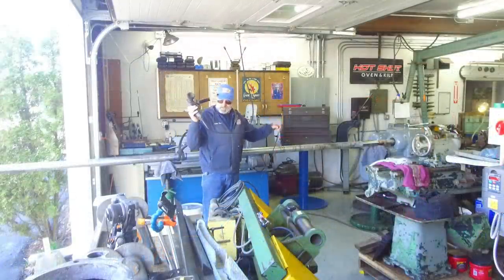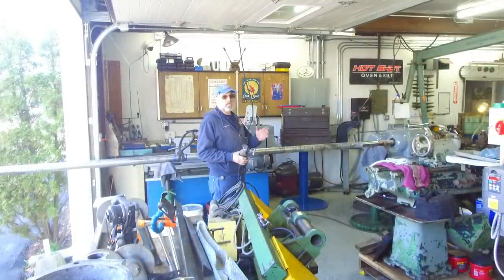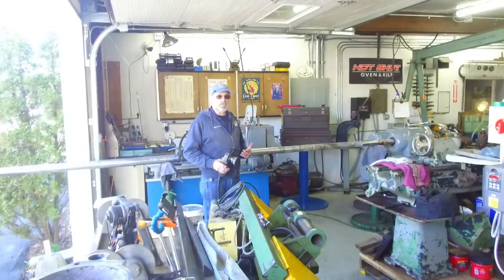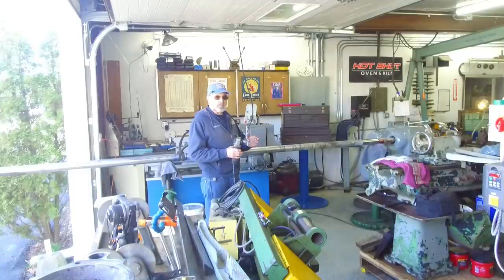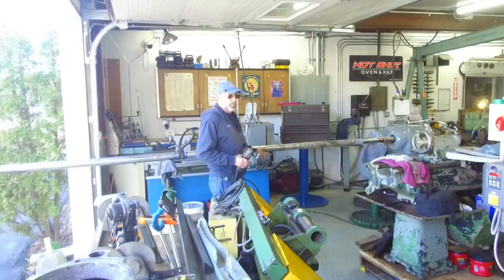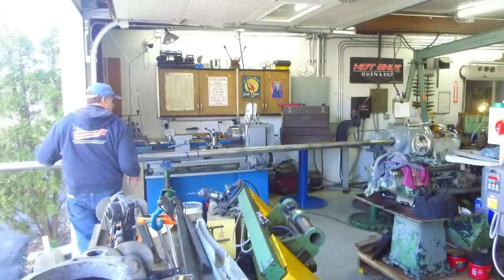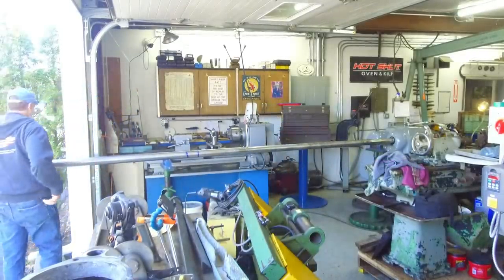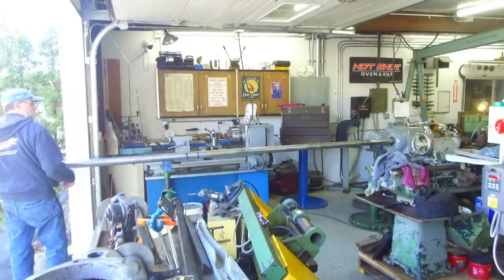We grabbed our stainless steel wire cup wheel. This is the only thing that you really want to clean marine shafting with, because you don't want to scratch it and you don't want to embed any steel in it. If you use a standard wire wheel on it, you will put rust into the metal. All right, I wire wheeled it and then I wiped it down with some acetone so it's kind of clean. And now I can go ahead and muscle it on in.